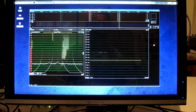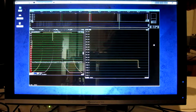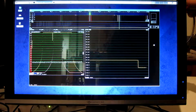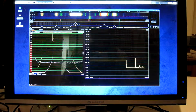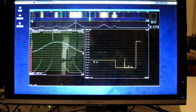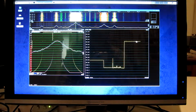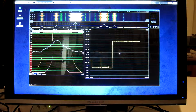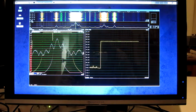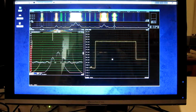And I can connect the antenna and listen to a strong signal, like this one. It has no interesting modulation at this time of day, but we can see the level is minus 54 dBm. That is with the amplifier and filter, but it's also a very poor antenna. And we can see some other station here. So this is a dBm meter and it's pretty accurate now.